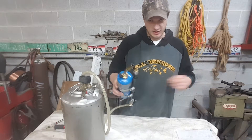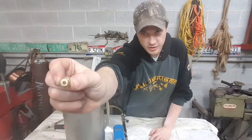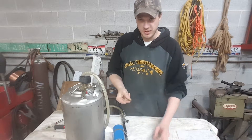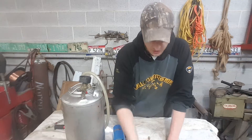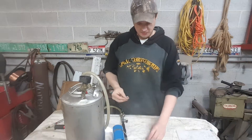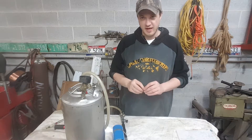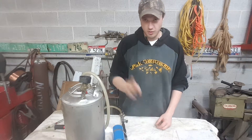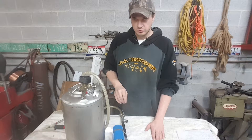This nozzle I've got here is my biggest one — that's the farthest shooting. The thicker the fuel stream, the farther it's going to carry. This little one I custom drilled is a .180 diameter — just a little bit bigger than a BB — and gives me probably 25 to 30 feet of range. My smallest one is a tiny little hose barb, 1/8-inch inner diameter, all threaded 1/8-inch NPT. That one gives me about 15 to 20 feet and it's best used in the backyard if you don't want to scare your neighbors. The bigger nozzles will light this place up like it's the middle of the day — don't do it when cars drive by.